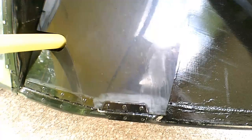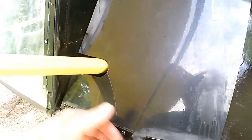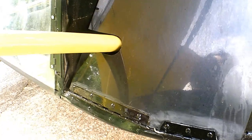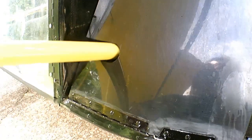Anyways, when I bent this like this, of course that's going to be weaker because that's transferring the motion back here, and all the forces go that way. So there's a small piece of aluminum that goes straight across to the one on the other side as a sort of anti-spreader, and it's riveted in there to prevent this tube from wanting to bend right here, to keep it from wanting to spread wider right here, because this is where it would bend more. Where you put that bend in it, it's going to bend more, and therefore I needed something to kind of brace that. So that's probably the major things that somebody would want to see that makes it look different.